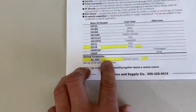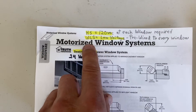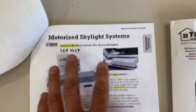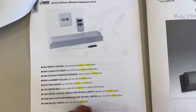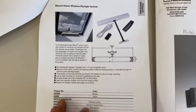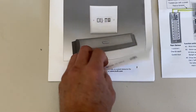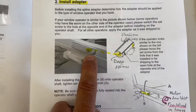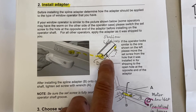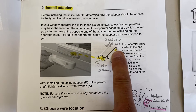Here's a list of options you can order. The HS model is 120 volt, and WLS is 24 volt. There's a page for HS models with their model numbers, and some other itemizations. If you want to have skylights, you can use some other hardware. To begin installation, you start with your window crank. The motor comes with a slide-in adapter — one end has deep threads, and the other end has threads on the surface that grab the splines on your window crank.